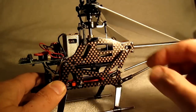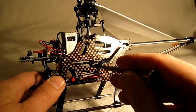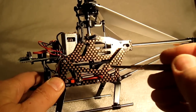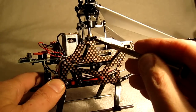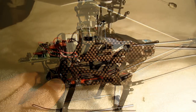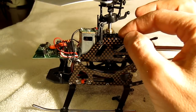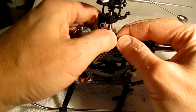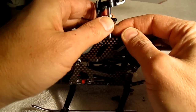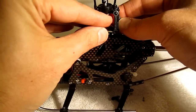To start the conversion, I'm going to pull off this coupler. I'm going to take off the screw from the lower gear and take off the three screws on this side and the three screws on the opposite side. I've taken the screws off and pulled this off, and I'm going to take the assembly out and then put it on reversed. I'm going to turn it around and then reassemble it like this.